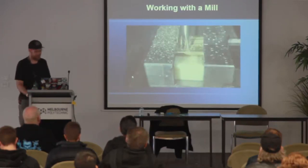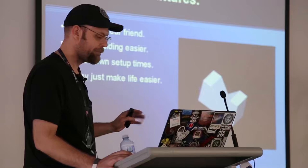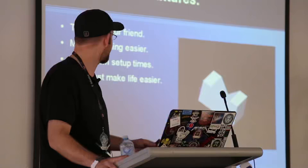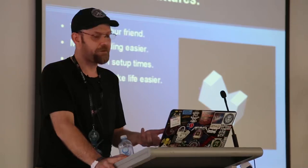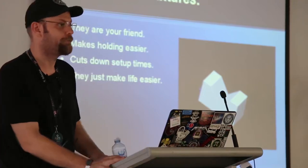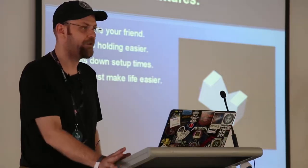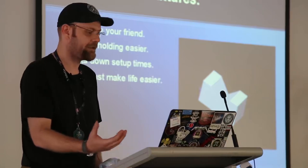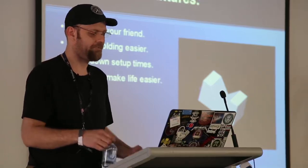While I'm cutting the lock body, my mill's running at approximately 2,000 RPM — that's as fast as my mill will go. So yeah, it's a little mill. I use a lot of fixtures to hold things — they're also called jigs. They're your best friend when you're doing repeatable work. When you want to do 10 of something, the 20 to 30 minutes it takes to make a fixture, you'll more than save double that time. They make holding things easier and help get your parts square.